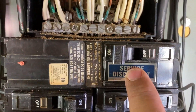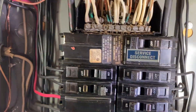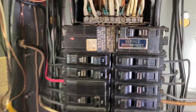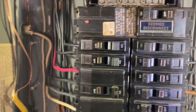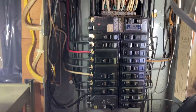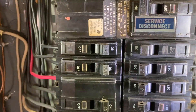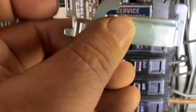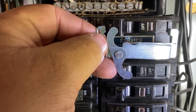This is my main service disconnect. This box is an older 1980s QO load center with one main breaker across the top. You may have the kind with a big breaker up top and you'll need a different style interconnect for those — they make all different styles. This is a cheap one, but some cost a hundred to two hundred dollars. This little interlock device will go here and stop it so you can't have utility power on at the same time as generator power.